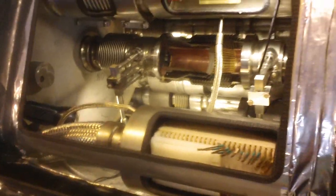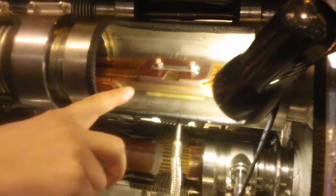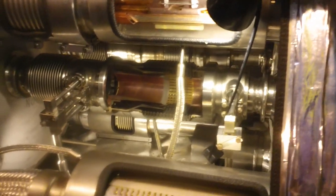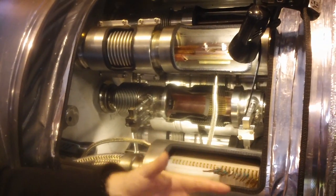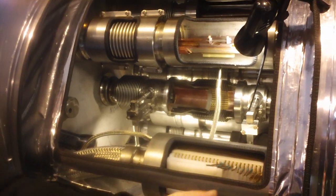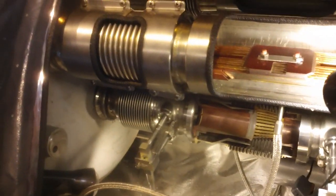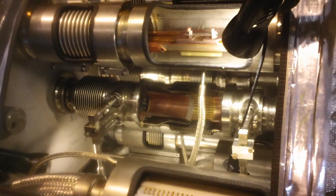This piece you see here is a very important part — it shows how two magnets are connected in the accelerator, the interconnection. You have the beam pipe and the cables which carry all the large current, and all of this has to be connected from one magnet to the other inside the machine. When you cool it from room temperature to a few Kelvin, the middle part of the magnet — the cold part — has to shrink, so there must be mechanical tolerance for this shrinking. You can see the beam pipe has a kind of bellow which can expand a bit.